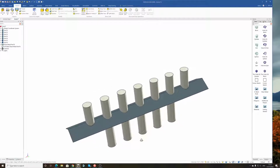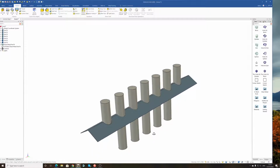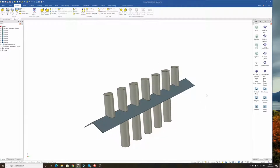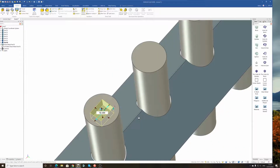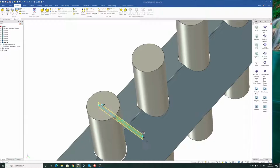And now, okay, I need to make sheet metal of this. I've got to do one more thing. So what I shall do is put in a hole block on the centre here. Now if I zoom in on this, this is something that I'm just going to cut away. If I then pick on that part and say I want 1mm, nice little thin slice, that's going to be for your welding around your cylinder.